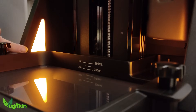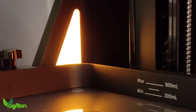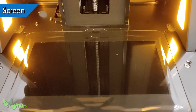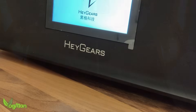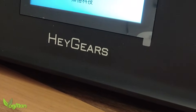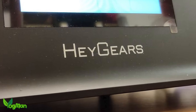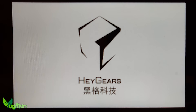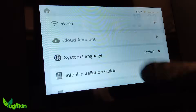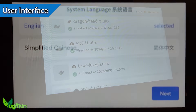The interior has soft lighting inside, which feels more aesthetic than purposeful and unfortunately cannot be turned on or off. The screen is a bit of a disappointment — it's a 10.3 8K monochrome which gives us 29.7 microns of XY resolution. But this seems to be the approach of Hey Gears: they're not racing to have the newest tech; instead they're striving to get the best out of what's known to work well. The menu screen is large, fantastically clear, and super easy to use.